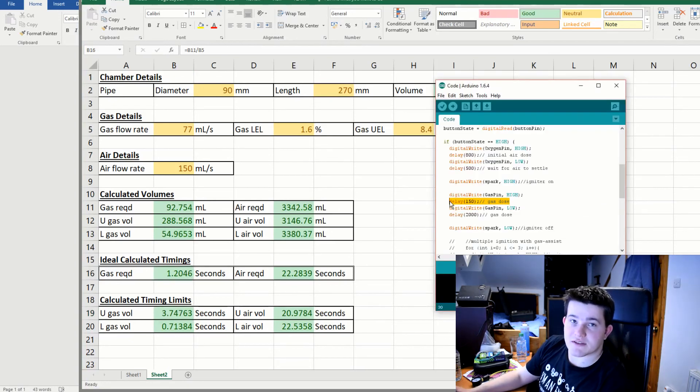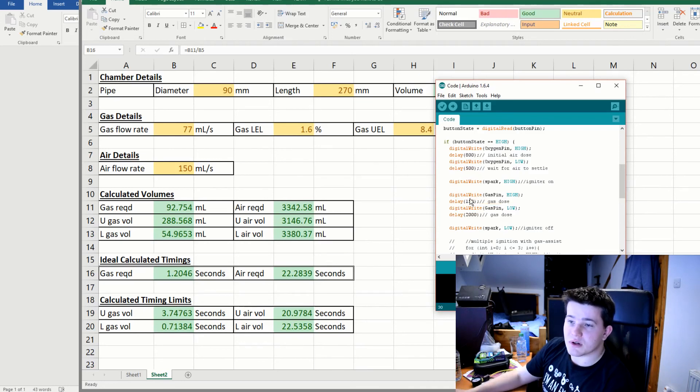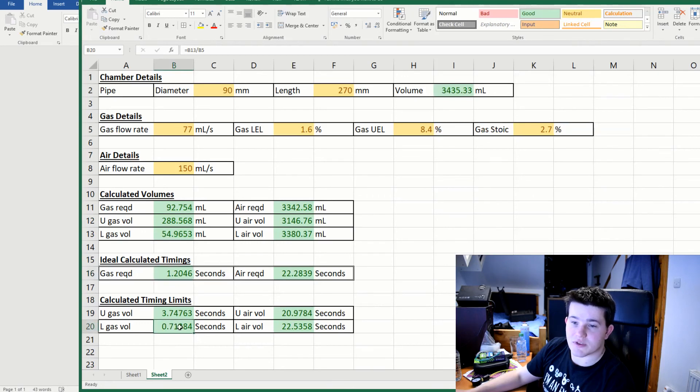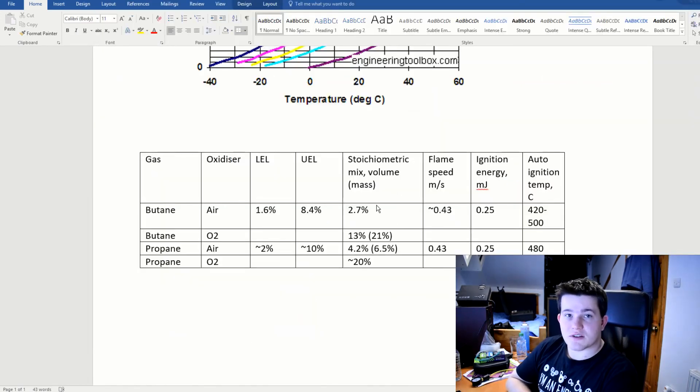I was trying to run some tests earlier and could not get the butane to ignite in the cylinder. What I think was contributing to that: one, it was really cold so the flow rate was probably quite bad; and two, I was only switching it on for several hundred milliseconds, when you can see it needs to be more than 713 milliseconds. That really goes to show it's worth working all of this out — I went through a couple of days of frustration not being able to get butane to catch fire.